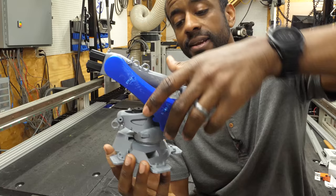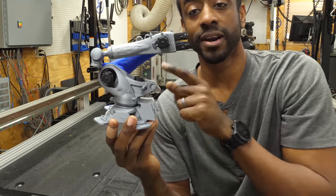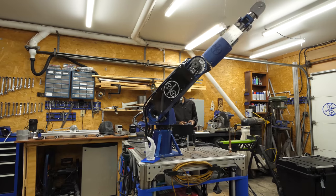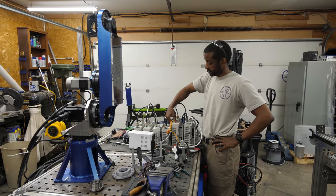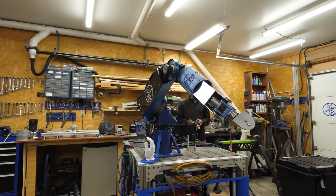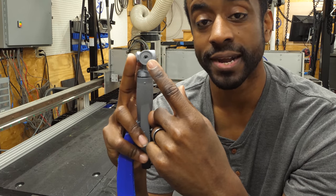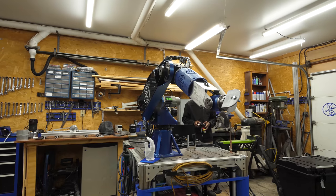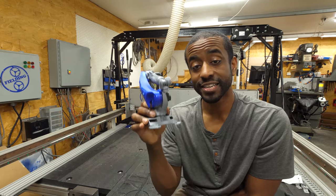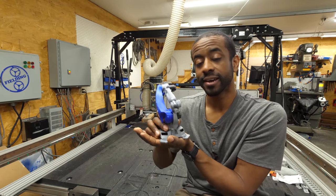Normally there's a motor right down in the center which allows it to pivot about its base — that will be axis one. Axis two has a motor here allowing the upper arm to move the body forward and back. Then there's a third motor allowing you to bend at the elbow and move the forearm. Beyond that, more motors in the wrist allow rotation and pivoting. Right out at the end there's often a face plate with a motor behind it to rotate whatever tool is mounted — a cutting spindle, a welding gun, or even a pneumatic gripper.